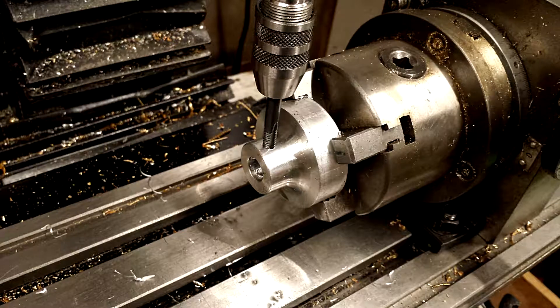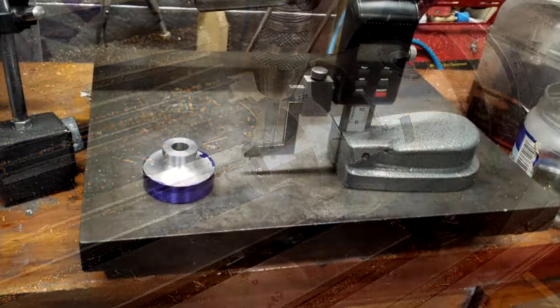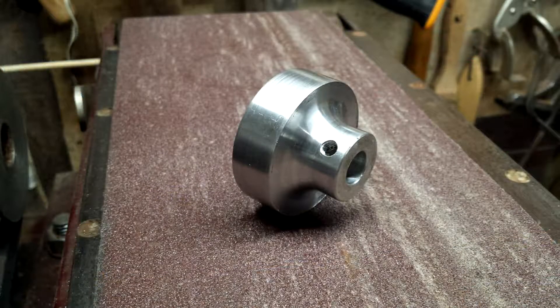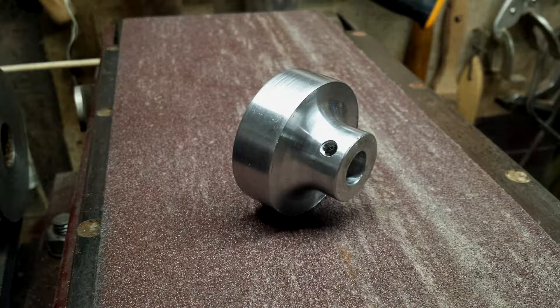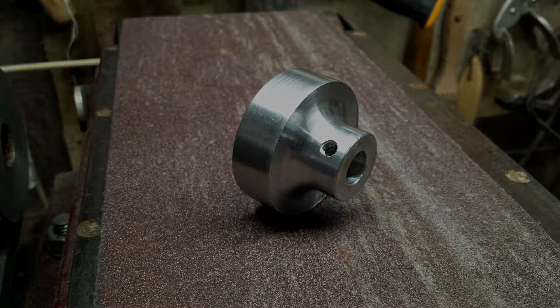To run a flat belt on a pulley, the pulley needs to have a slight crown on it — that's counter-intuitive. You might think you'd want a hollow in the middle, but no, it's a crown that you need. I use my height gauge to mark the face of the pulley into roughly three sections, then turn down the outside edges at a slight angle so the pulley ends up wider in circumference in the middle than at the edges, creating the crown. Thanks for watching — hopefully you'll join me in the next installment.